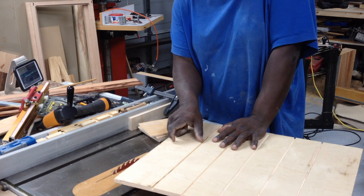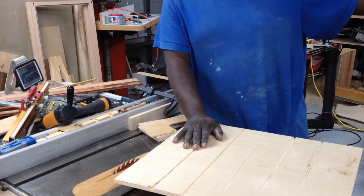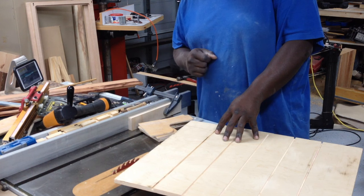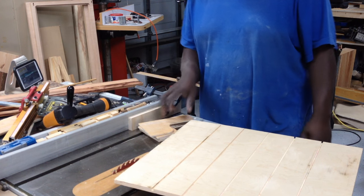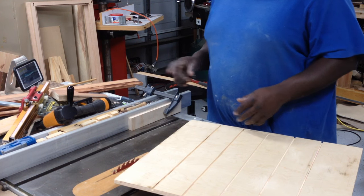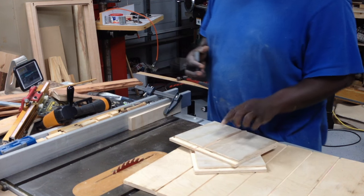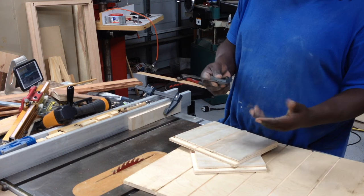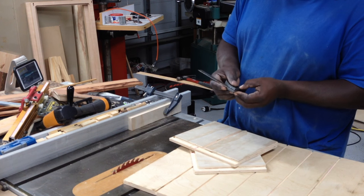five. We're gonna go ahead and figure out how wide to cut this, and then cut off the excess, and also cut a piece from the other piece of half-inch ply over here to form the back and the bottom for the compartment to hold the nails and supplies and whatnot. So the way we're going to figure this out is we're going to take a look at just how deep this dado is. I didn't make it any specific depth. I just figured I'd build to the project. Turns out it's roughly about a quarter of an inch.